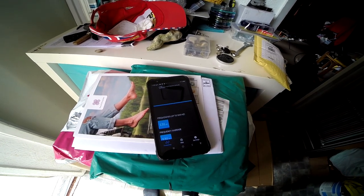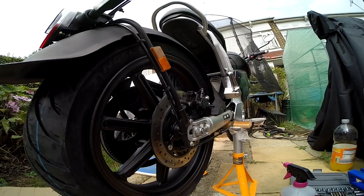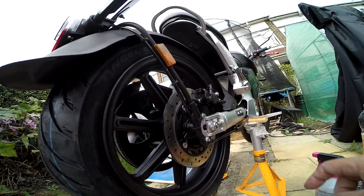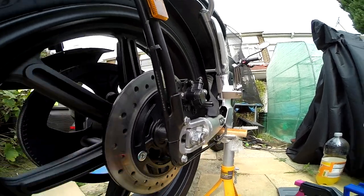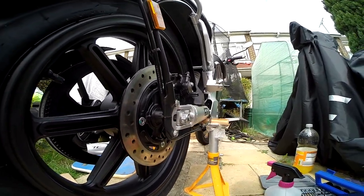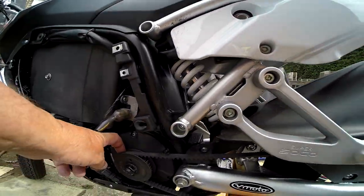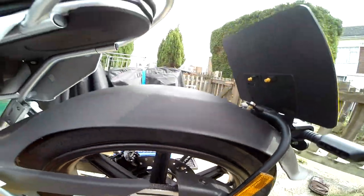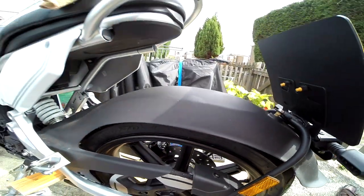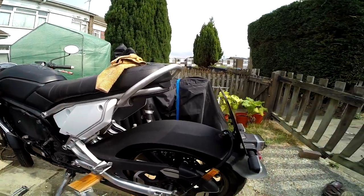I've achieved 88 Hz — all checked, all done. The spindle is easy enough to put back through. Don't forget to put a bit of grease on the joins where the spindle sits, and the wheels spinning freely. I ended up at 88 Hz for the belt frequency. She's on the outer edge at this end, and sitting in the middle at the other side so she'll work her way back. There's plenty of room on the width of the carrier — I might need to angle the back wheel slightly to adjust that. Everything's done.